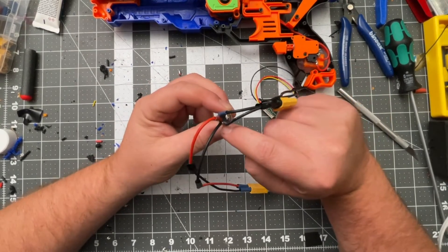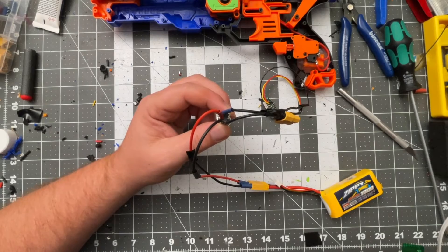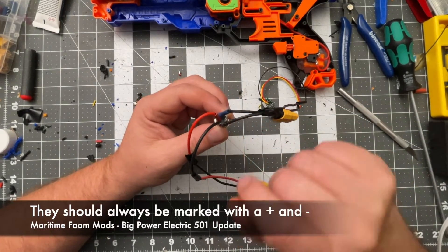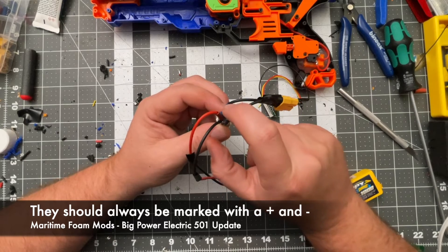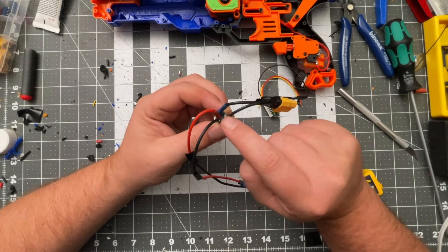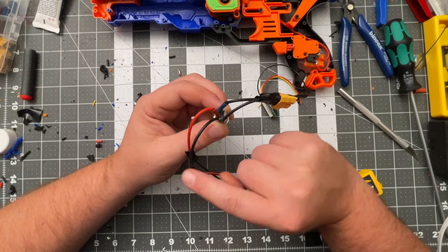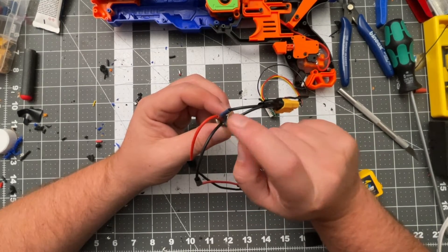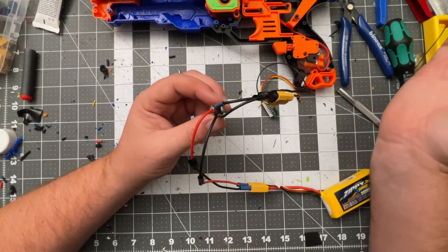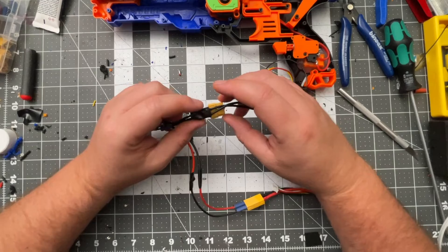You can wire up these switches a few different ways — always on, or on until you activate it and then the light goes off. I have it so that when you press it down it lights up when the blaster is active. So to summarize: 12 o'clock is positive, 12 o'clock goes over to 3 o'clock positive, 6 o'clock is negative going back to the battery, and 9 o'clock is positive going back to the battery positive.